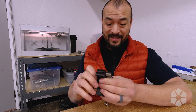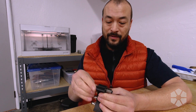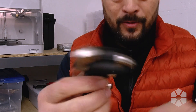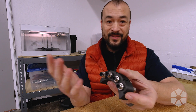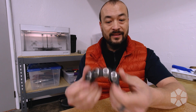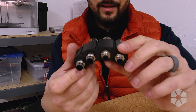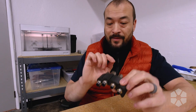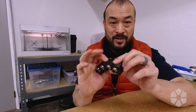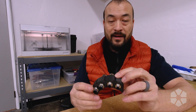I did not do that in this occasion, but in other circumstances that has been incredibly helpful. I'm only using two fours and one six right now, but this one's capped off so if I need to run a second line I've accommodated for that. I also made these little grooves on top to carry one of the sensor wires — I really just guessed at the dimensions. In my mind that wire is going to run through the little groove and I can just push it down and it'll hold it snugly enough for operation, and then you can just pop it out when I remove that tool.